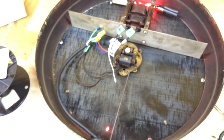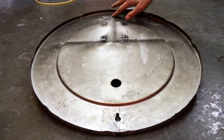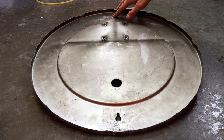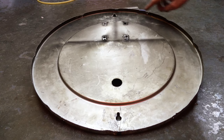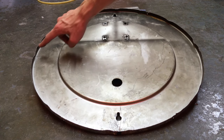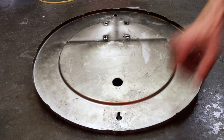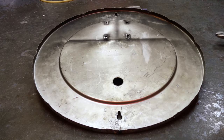Got a knot in here for strain relief and a brand new grommet as well. Successful — gonna reassemble. One more thing I'm gonna do here: the top hole got a little twisted. Somebody torqued the hole or something pulling off the wall. Also the outer edge of this can looks like somebody opened it with a screwdriver, kind of like a paint can. I'm gonna use a crescent wrench to straighten those back out.